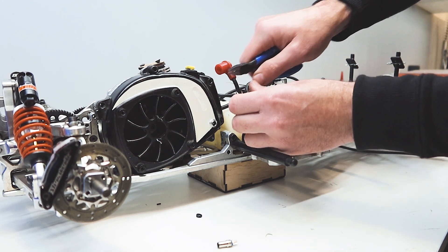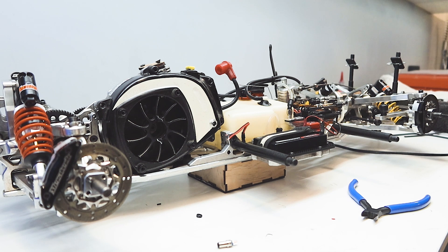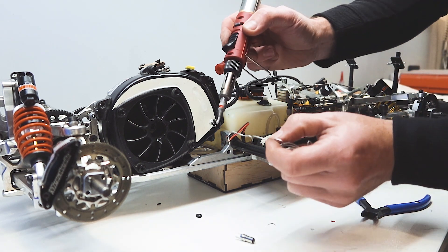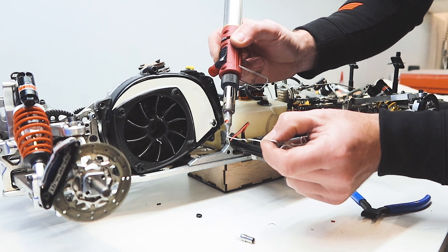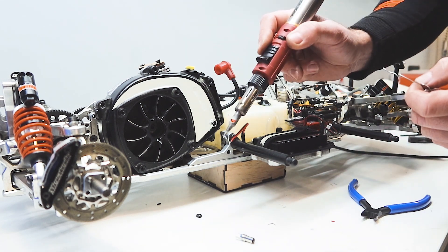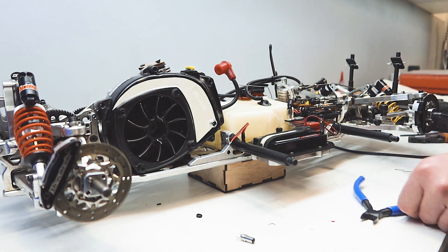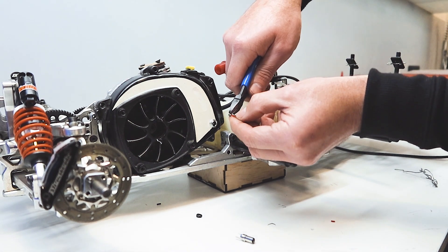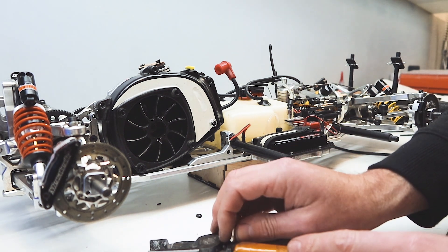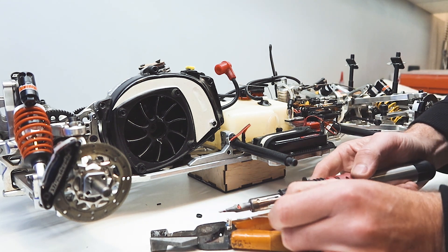We don't need to strip that back much - it's only a couple of millimeters. Just like the other techniques, we're going to tin that first. We'll tin these couple of wires - dab of solder, heat against the copper, and that's it. We'll just trim those a little bit because we only need them a couple of millimeters long, just like that. We'll tin the plug next - I'm just going to hold that in the pliers. Same technique as before.